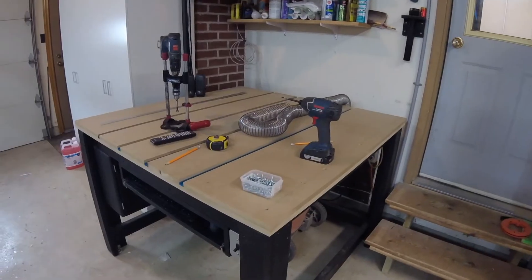On top of the machine cost, I had to buy a router — it uses the Makita trim router, the small handheld one. The other big cost is building a table, which is kind of where I'm at now. The mill is on its way and in shipping, so I'm currently working on building the table. I've already built the 4x4 tabletop with MDF, put on some T-track, and I'm adding MDF spoil boards in between, which the CNC will surface and level off to prep for its arrival later this week.